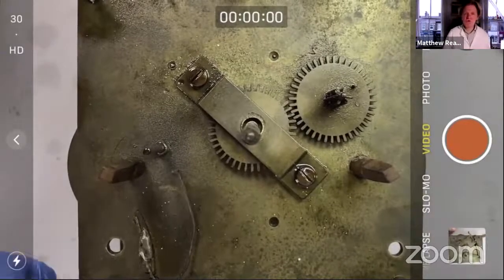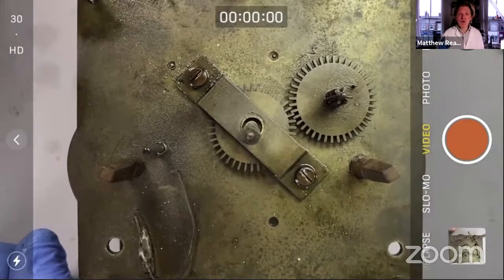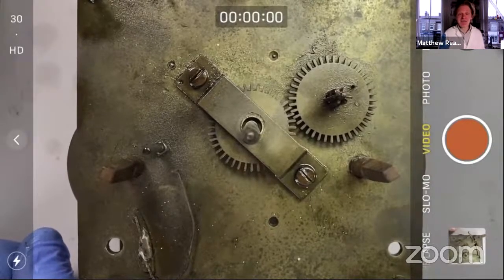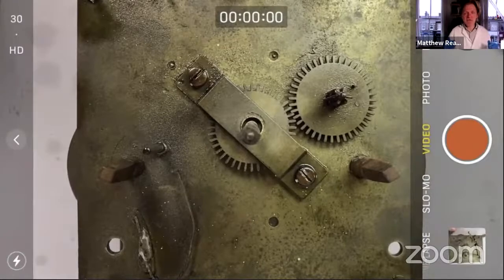Yeah, good question from Chris about laser welding. There's a mass of that technology in industry, and it's the same old question, I'm afraid. I really wish horology, the professional institutions, would invest in that kind of research and hook up with universities who are doing this kind of work, because I know with laser welding, it's not as simple as infilling the space and then grinding it away, because there are all sorts of different hardnesses of filler material. Presumably you want a hardness of filler material that's similar to the host component. And there are also boundary issues where you have a boundary hardness or work hardening or something.